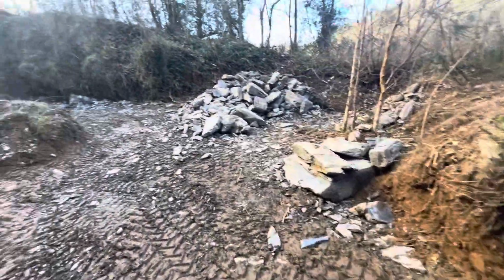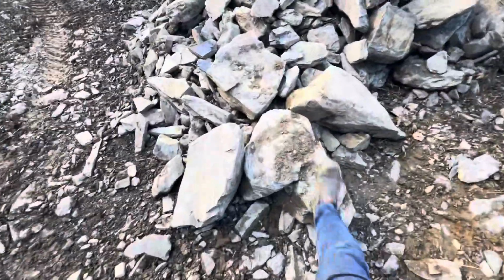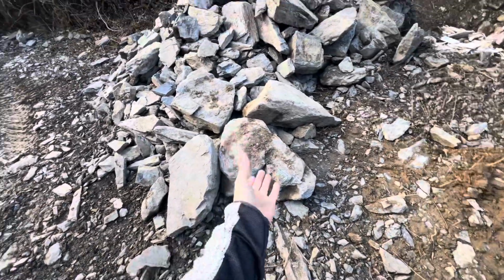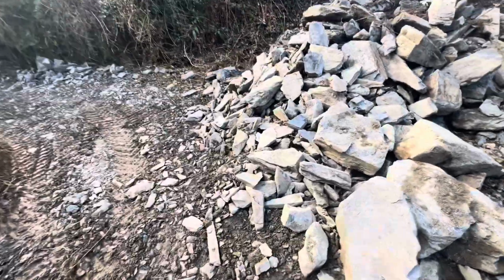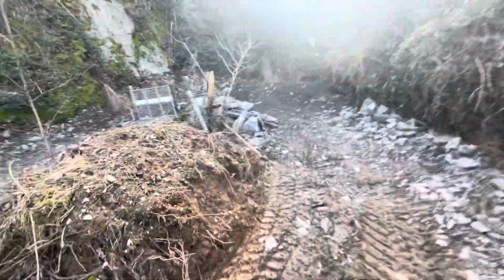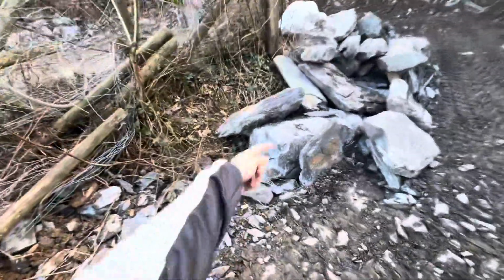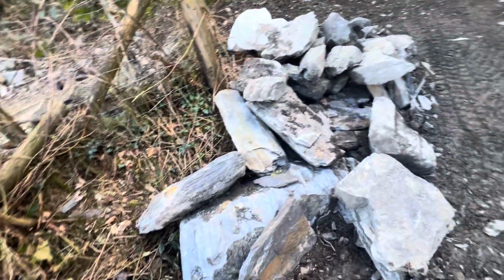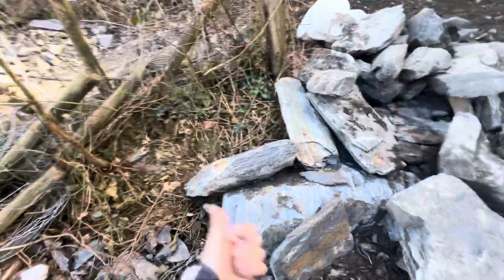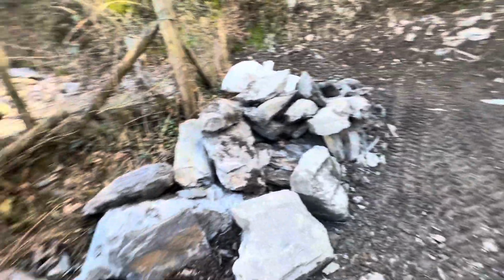It's bloody heavy. And I'd come around with the digger. That one there's a completely different shape to the others. Look, a bit more rounded, a bit shorter, a bit thicker. So what I need to do is place these randomly and come round and choose what I want. Sometimes I want big, long, flat ones. That one there's quite a cylindrical shape, look, but it's got quite a good mass to it. So I don't want to put it up too high. That might come around and do the side bit where I want to taper it up the drive. So it's nothing more complicated than selecting some of these rocks that I've got and just building a wall.